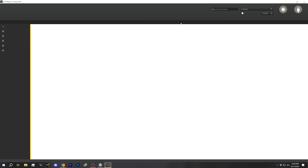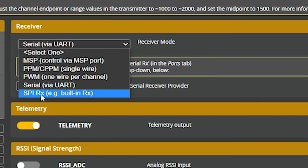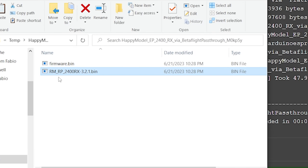Everything I'm talking about in this video pertains only to serial-based receivers. If you have a tiny Whoop flight controller with a SPI-based receiver, what I'm going to show you is not going to work. The way you can tell which you've got is to go into Betaflight Configurator, connect to your flight controller, go to the receiver tab, and if it says receiver type SPI and receiver provider ELRS, then you have an SPI-based receiver with a different set of instructions. Those are getting more and more rare. The build has finished and now we have a firmware file.